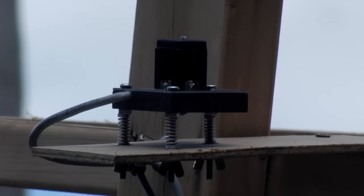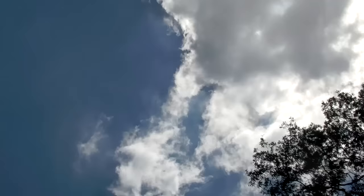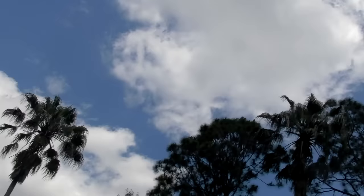At the heart of the solar tracker are five photocells that are easily adjustable and keep our lens on target most of the day. While four photocells are all that is required, the fifth cell detects cloud cover and prevents the motor drives from running wild guessing where the sun is.